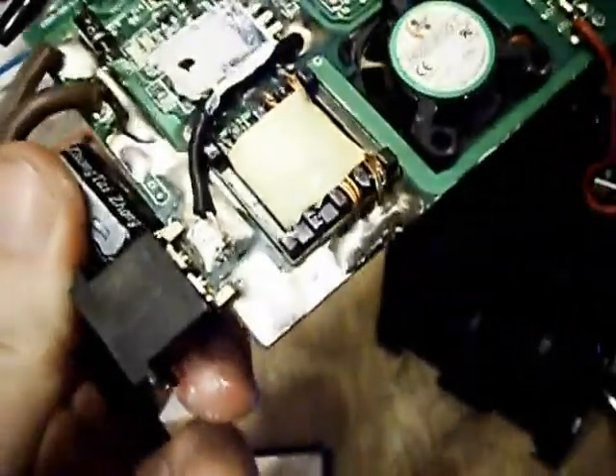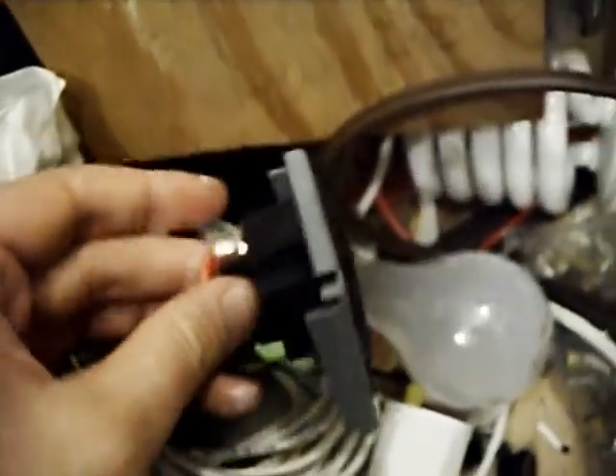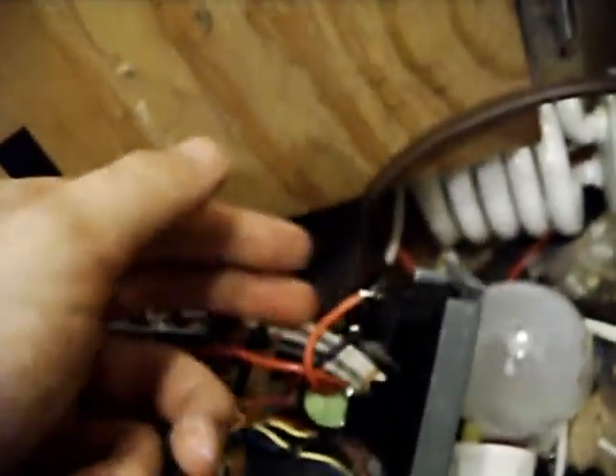That third contact is just the ground, which is tied over to the DC input neutral. That's actually something you don't often see in cheap inverters like this — where they actually have a ground. Things like this PowerToGo right here, as you can see in its receptacles, don't have ground connections in them — they don't even have the terminals installed. I've seen some inverters where it's a standard panel-mount NEMA 5-15 receptacle with the hot and neutral wired but the ground lug left unconnected. But these don't even do that — typical cheap Chinese construction.